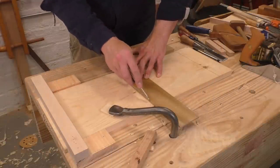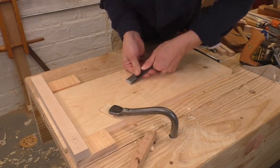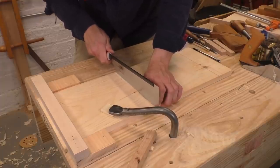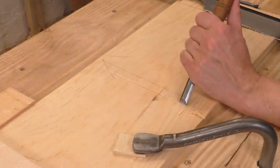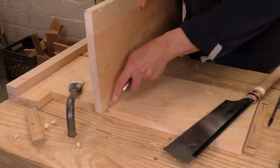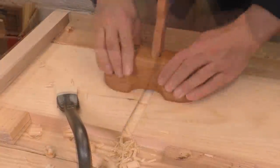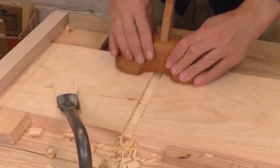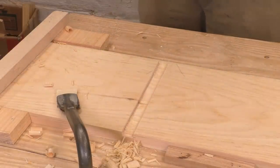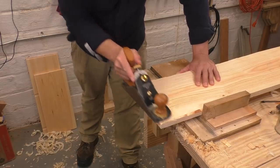Even with the shoulder cut, I don't want to go across the grain with my rabbet plane until I've chiseled out most of the waste. Use a big chisel and move fast — this pine is effortless to split. When the joint is close, finish up with the rabbet plane. Now I'm going to cut the dados that will house my shelves. I score the cut lines with my stockman knife, make a knife wall with my chisel, and saw down one wall of the joint. Chisel down your first saw cut to make a trench, then tip a piece of shelf stock into the trench and score a line a little bit inside where the stock lands — you're aiming for a dado that's too narrow, intentionally. Once you've sawn your second line, pop out most of the waste and flatten the bottom with a router plane. The point is to get a consistent depth. Later, we'll get that tight fit by taking a couple of very light shavings off the edge of the shelf on the underside where no one will see.